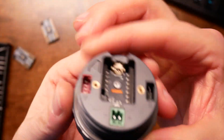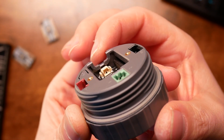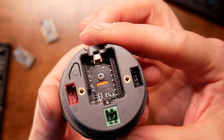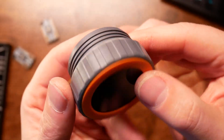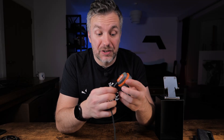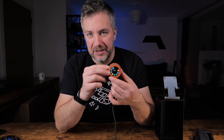The power input is a 2-pin DC port that supports voltages from 5V to 36V. If you take a screwdriver and remove the M5 stamp from the dial, you'll notice there is an additional 2-pin header hidden underneath it — very tiny — and this one is to provide the built-in RTC, real-time clock, with a backup battery. Of course, if you just want to play with it, you can use USB Type-C to power the M5 stamp, which will power the dial and let you program it that way.